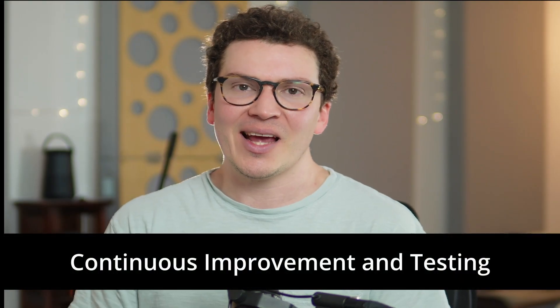I've done the Bass Hunter technique, I have a large cloud absorber overhead helping with low end, and I have my speakers up against the wall — I really like this approach now. The only thing that could be better is surface mounting the speakers in a very stiff wall, but I'm not sure I'd recommend that for most home recording studios. If you put your speakers in a fixed wall position, you lose the flexibility to widen or narrow your placement or sit farther back over time.